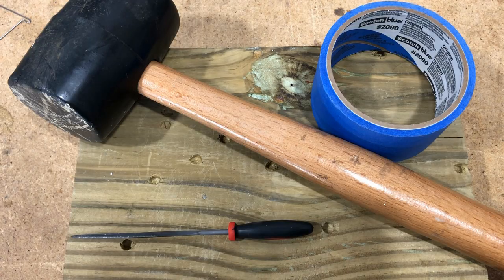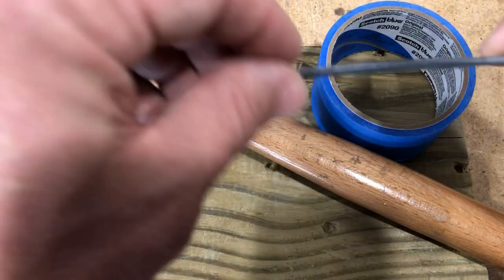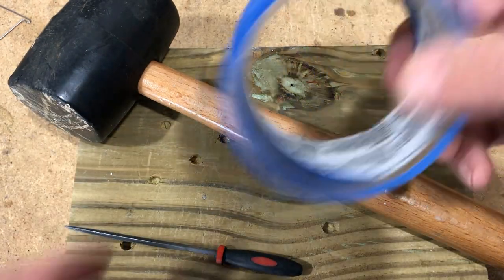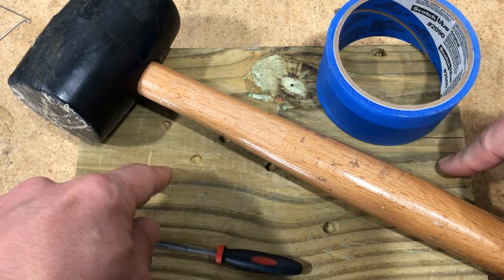Today, let's get into modifying this mold. Tools of the trade for my approach: we're going to need a rubber mallet, a triangle file — that three-sided triangle file — and some blue painter's tape, as well as a piece of wood.